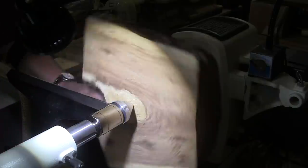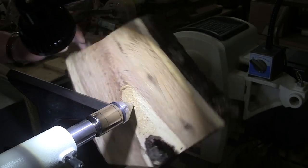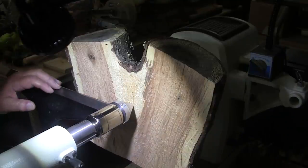I'll do the turning, you do the holding the breath. Let's see what kind of speed we can get. About 410 RPM. I'm going to be using a freshly sharpened 5/8 inch bowl gouge. I'm going to wear a glove, mask, and face shield on.